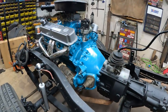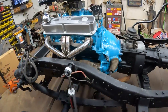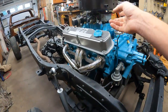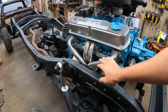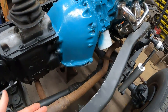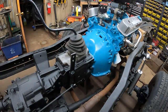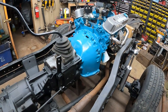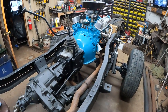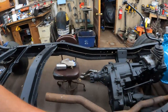So the last video I teased this a little bit, that was like a week ago. I had the stock head pipes off the other truck. These are headers. Magnum motor, LA style headers on a Magnum motor, and they would essentially almost line up with the stock pipes, but I'm not going to use them since it dumps the exhaust down to one side. I want to run duals all the way back, and because this truck is a 1980 for New York State, I need to run catalytic converters because it had a converter on it back here, actually back about here from the factory.